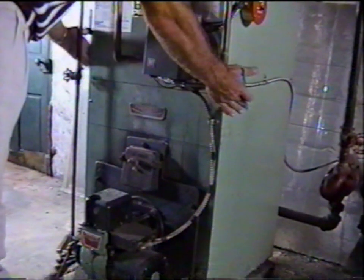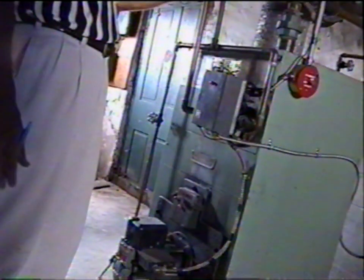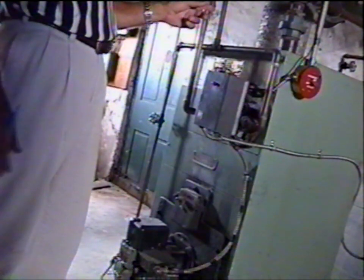When you turn on the faucet, hot water's coming out. So that coil starts to cool, and it gets to below a certain temperature. This boiler kicks on, and it heats it up. So you're constantly running water, and you'll get hot water coming out. This is it for the hot water. You got cold in, hot out. We run that. The dishwasher's running. It's asking for hot water. So that's what's kicking this on.